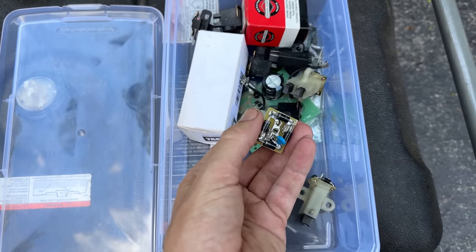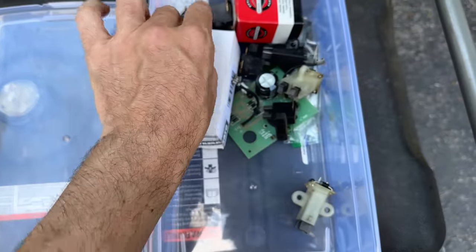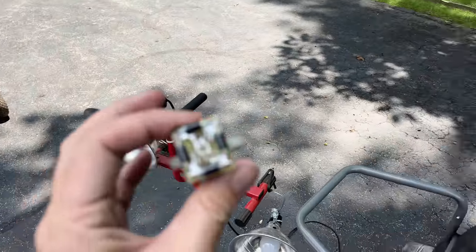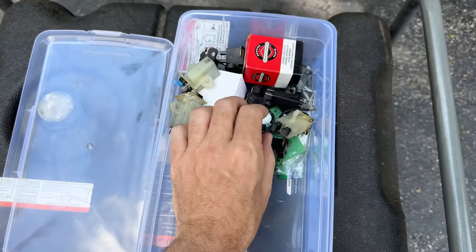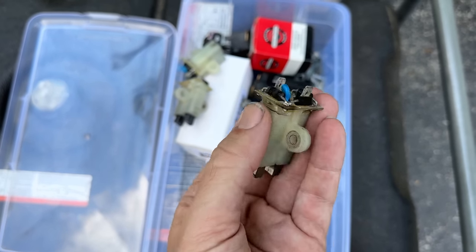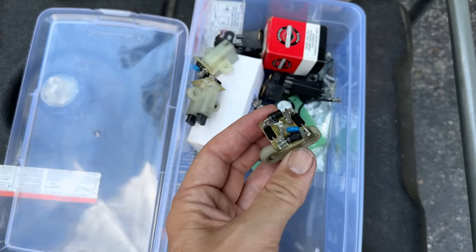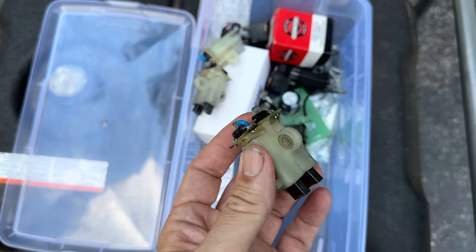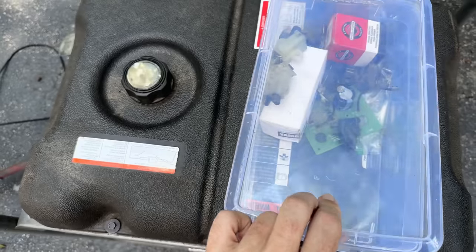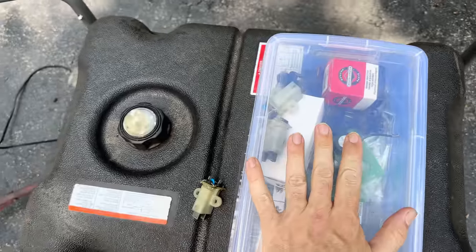So I do have, I think, another set of brushes I can use. Not that one. This is the one I just pulled off the other machine that is definitely bad. And this one I repaired previously. I wouldn't say it's the best repair. You can see some burn marks where I kind of reattached the good diodes. But this does test well, so I think it'll be good enough to at least test with. And if we can get this machine to make power, I'll just order a new part.